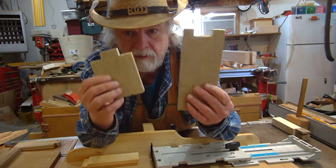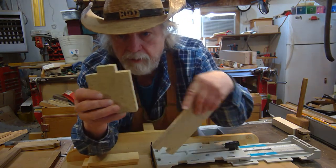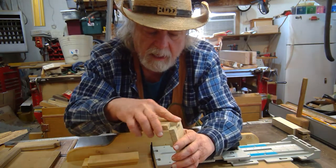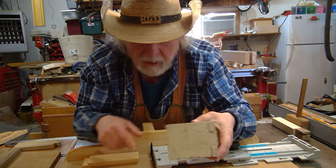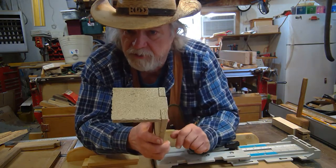You're going to put them together at 90 degrees. You put two fingers on the one board, the center finger on the other board, and then when they go together, if you do a precise cut, you get a nice long grain contact on solid wood to make a nice solid joint — and that's more than enough to make this joint pretty strong.